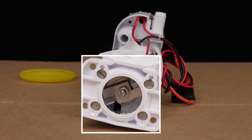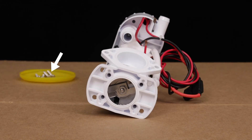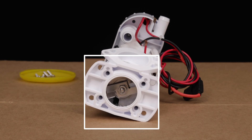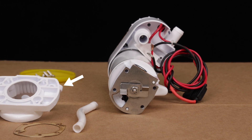We recommend you remove the pump system from the base and perform these tasks on a workbench. Starting with the output side, remove the four screws that secure the macerator housing. Note that there are two long screws and two short screws. You may want to use a marker on the housing to indicate which screws came from where, for easier reassembly later. Pull the housing off the base, along with the gasket, then remove the vent hose.